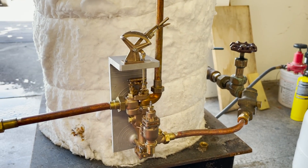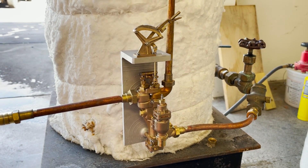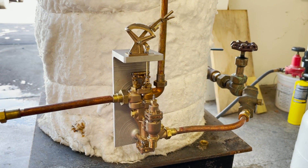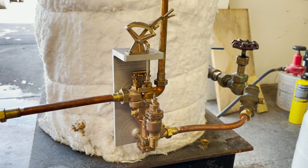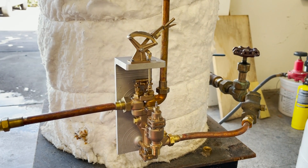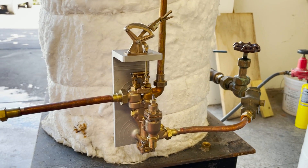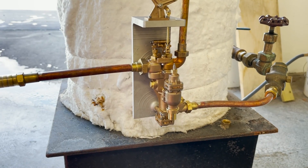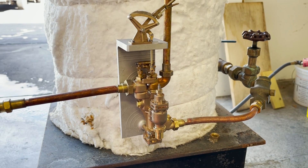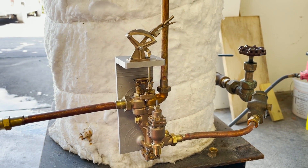The prime position can still be pretty useful if your feed line gets a little hot, or maybe if you have a slightly leaky check valve and hot water is coming into the injector, or if it just gets a little bit too warm for some reason. If you just put it in that prime position and leave it there, that is the ideal position to suck in the water. Let's try to simulate that — I'll block off the overflow and shoot some hot water back through the water line to get it a little bit overheated so I can show you how the prime position helps.